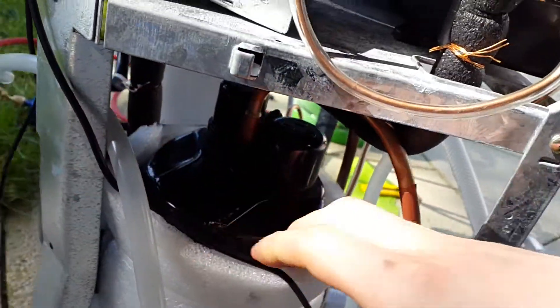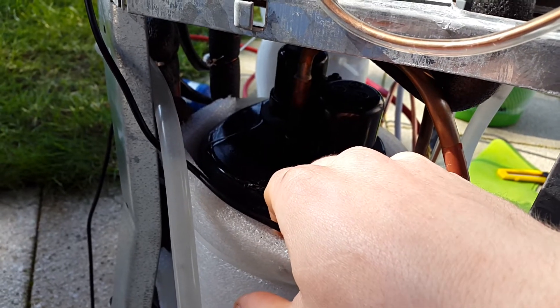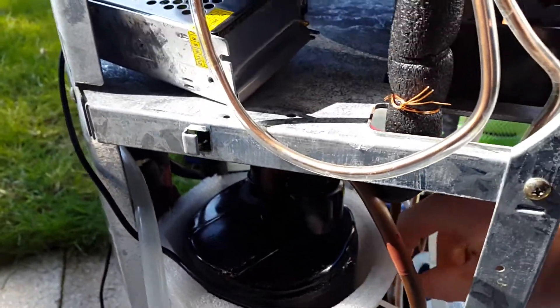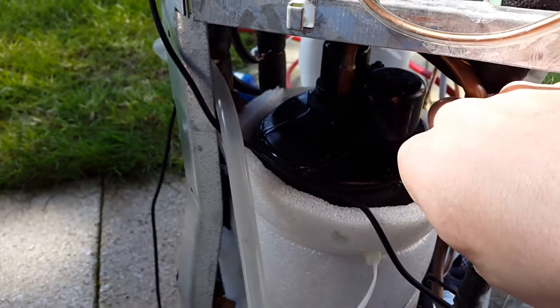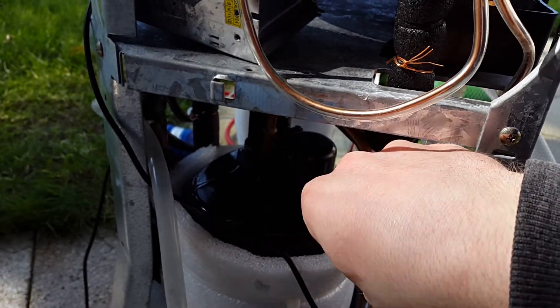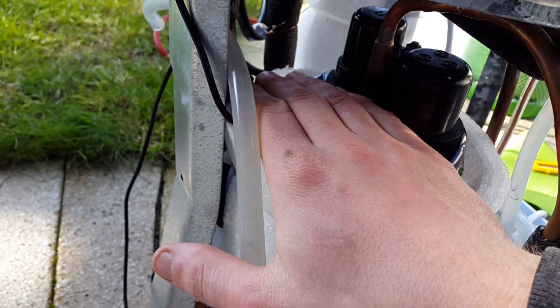I've noticed the system seems to have strange temperature fluctuations — sometimes the compressor starts getting really hot and then cools down. It's currently reasonably cold. The discharge temperature also seems to have gone down a bit. It just seems to go through cycles and I can't explain why.